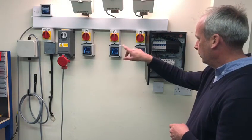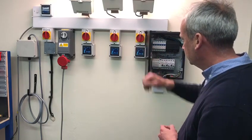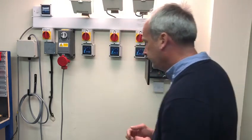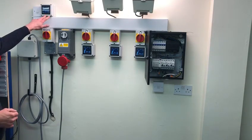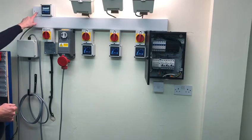There are three meters — L1, L2, L3 — each showing around 240 volts, with three loads. Up here, this is actually measuring the neutral to virtual neutral, which saves you from installing an earth rod. I'm now going to switch the neutral off to simulate an open PEN fault.